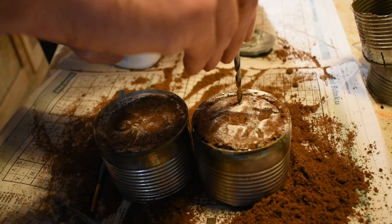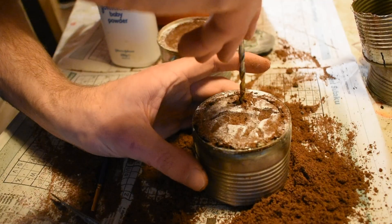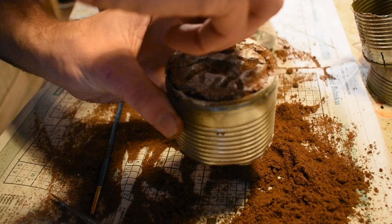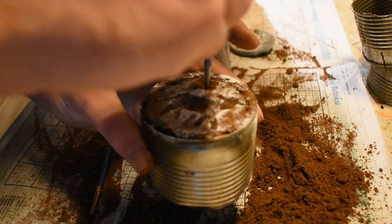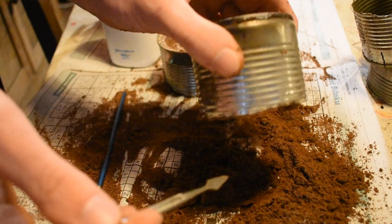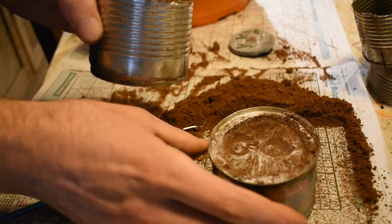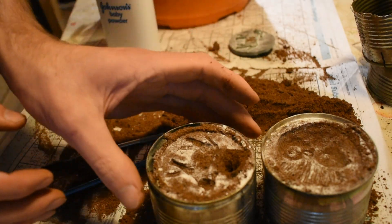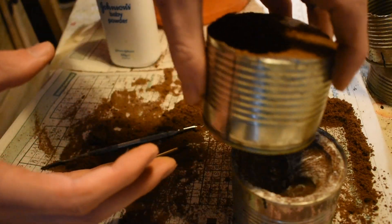The last step after you've made your moulds is to drill a hole into the mould so you have a sprue — a place to pour the metal in. On my model I had a flat surface, so it was an easy decision of where to put it. It depends on your model where you want to put your sprue. You can use a tool to clean up the edge and make sure there's no loose sand, as any loose sand will come out in the metal when pouring. Then leave the moulds to dry for a week or longer before you pour the metal in.